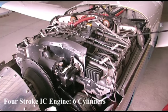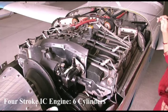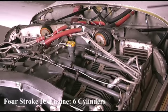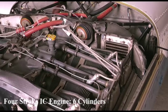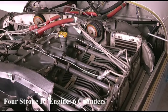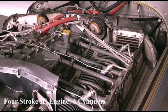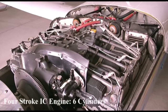These are the fuel lines going to the various cylinders which supply the fuel. Behind, you can see the engine mounts on which the engine is mounted, the coolers for the engine, and the hydraulic brake fluid which operates the brake. Behind this wall is installed the magneto which supplies ignition power to the engine. It is connected to the battery; the battery cranks and starts the engine, and then the engine supplies power to the aircraft.